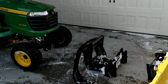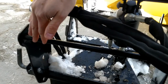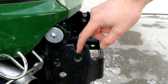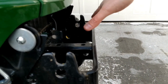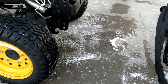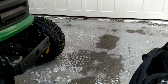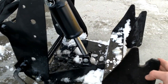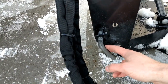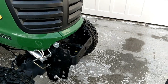It's just a couple of steps really. The first step is going to be putting this quick hitch onto the frame of the tractor. You'll see this rod that goes right across here — that rod we're going to set in this groove right here. So it's just going to rest right in there. Now the second part of that will be hooking up the hydraulic hoses here, which we'll just plug right in with these quick connects. After that we're going to turn it on and lift the front of this quick hitch up so it's off the ground a little bit, which will help us rock it back so that we can get these pins latched right in their holes — one here and one on the other side, just identical. So that's the first step.